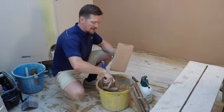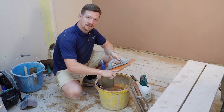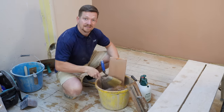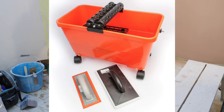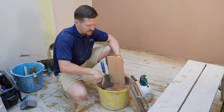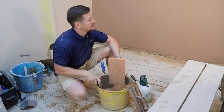This is the reason why it's so good to have in your arsenal. You might have a bit of plaster that's set beyond repair — spray water on it, sponge it up and you've saved yourself. One of the downsides of this is it's quite messy; there's a lot of cleaning up and the sponge floats always seem to fall apart, so the cleanup process is really annoying — probably the bit I hate the most. You can get sponge boys, which are basically tile sponge cleaners. The extra work involved is sometimes enough to put me off, but the finish is amazing.